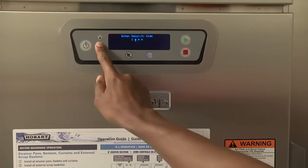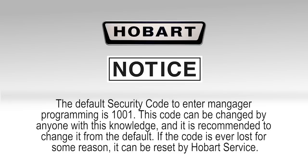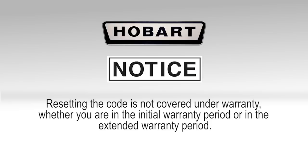Note, the default security code to enter manager programming is 1001. This code can be changed by anyone with this knowledge, and it is recommended to change it from the default. If the code is ever lost for some reason, it can be reset by Hobart service. Note, resetting the code is not covered under warranty, whether you are in the initial warranty period or in the extended warranty period. 5. Press the Enter key to move to the next digit to the right.